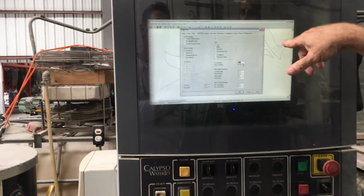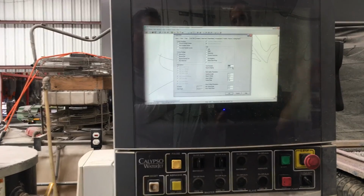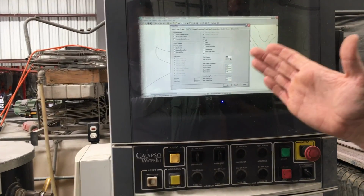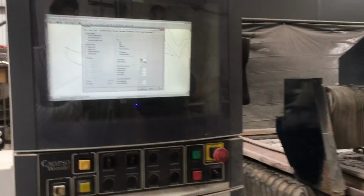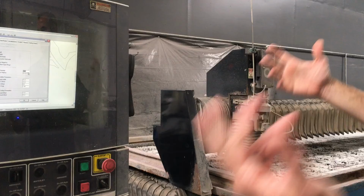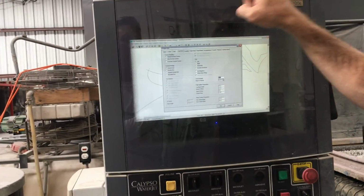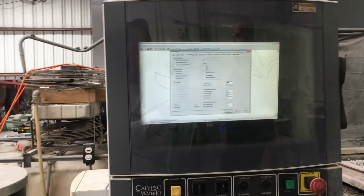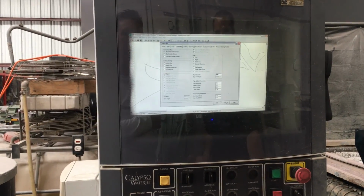Tolerance at all. So you would set that tool diameter to 30 thou. It's going to be so minute you're not even going to see it. But when you're dealing with a tolerance, that's the number you're going to adjust. Then I cut a circle, mic the circle, cut a hole, mic the hole, and I know I'm on point. Gotcha. Then I go through and map the whole thing, and when I save it, I always go back into this and go back to the original, so I don't do it to the next file, in case it was something that I didn't need to hold tolerance.